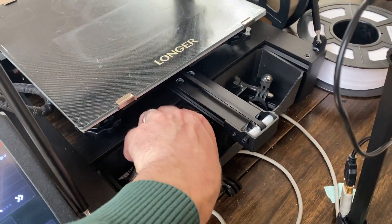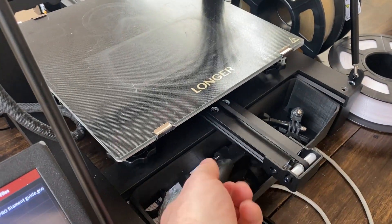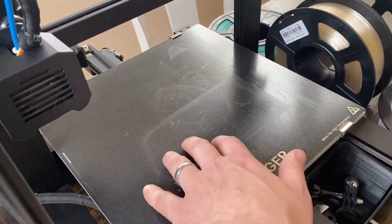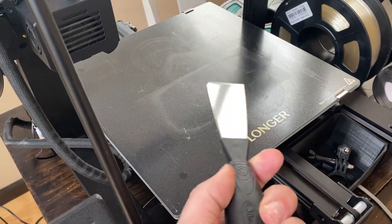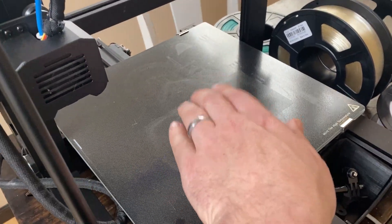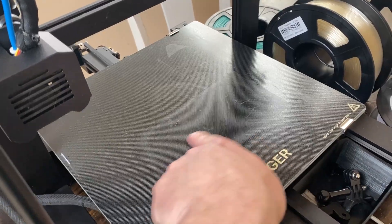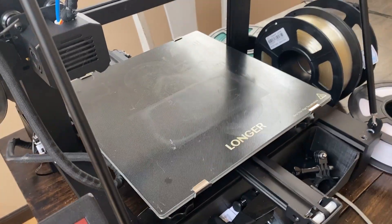This is just where all my different junk is - some things I've printed, practice things, and a little spatula to peel things off the surface. This bed actually moves back and forth as things print and it heats up as well - it's a ceramic coated glass bed. You print your object on there and then just take a little knife and work at it a little bit and it'll pop right off once the surface cools down. It actually bonds your item to the surface as it prints. For smaller items, you can print what's called a raft - it'll print a small plastic flat bottom piece and then print your object on top of that, and it just snaps right off when you're done.